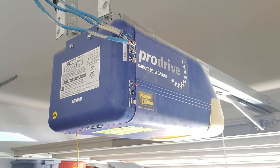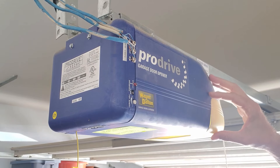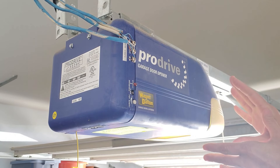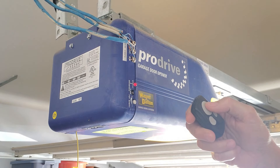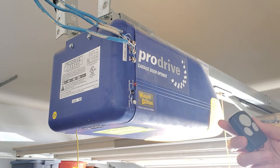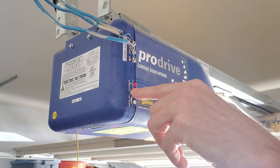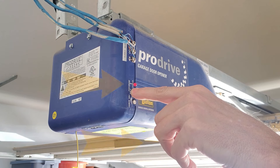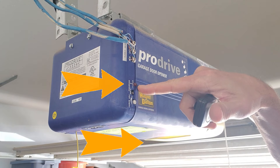But today we're going to be talking about the garage door opener itself. When you first purchased your house, how many garage door openers did you get with it? One? Well, that's a problem because every garage door opener comes with two. So if you only got one, that means one is out there floating around. Also, modern cars actually have garage door opener buttons built into the mirror, so they could be programmed to open the garage door. So even if you got two remotes, you don't know if the previous owner's car can open your garage. It's very important to clear out all the remotes and then add the ones in your possession back in, along with any vehicles you have.